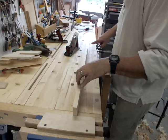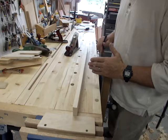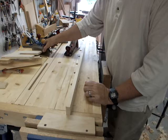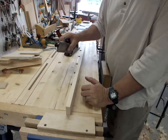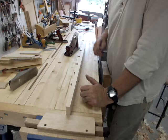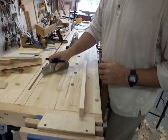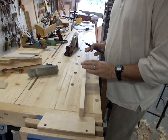On some woods like oak, the grain rises up to a knot and you're working against the grain in two directions — that's when you really cannot plane the wood. Not all woods can be planed, and that's where I go to a number 80 cabinet scraper, or you might try a low-angle plane. I don't have any great love for those; the ones I own are block planes. I don't think they're necessary based on all the work I've done without one, but I'm not saying you shouldn't have one — it's just not something I've ever struggled with enough to need. I'd go to a number 80 cabinet scraper, do some light sanding, and you can get past the problem.